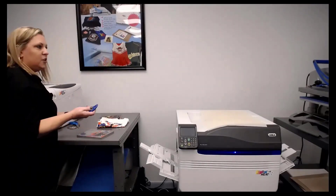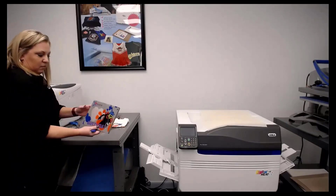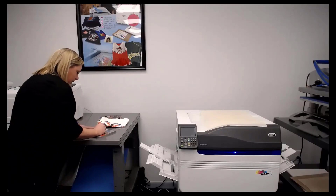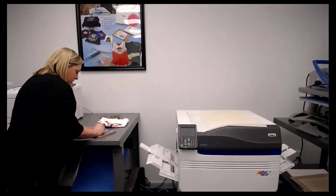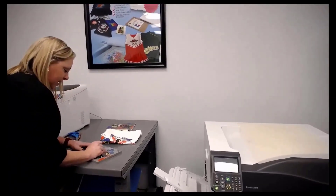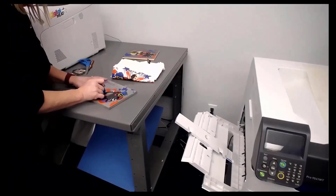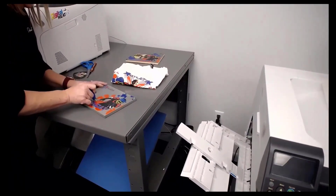The wood is probably ready to peel. I want to show you this, because it's something you need to do — I just grab an X-Acto knife and kind of punch in at the edge, just because the toner is still connected to the sheet and I don't want to rip it away. You don't want to peel it aggressively.